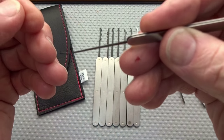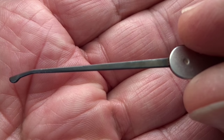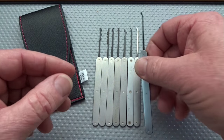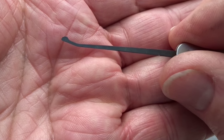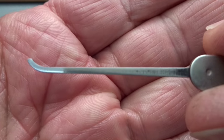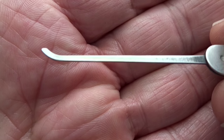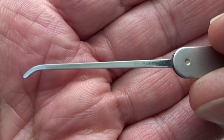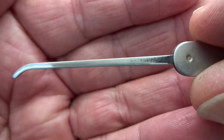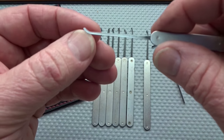I've picked a lock with them — they're not bad. Everything's rounded off, no sharp edges. If you take a close look at the picks, they are going to need a little bit of work. These are blackened, and I was a little worried about how durable that finish was. This, by the way, is a DeForest half ball — a good little pick for high lift. I went ahead and polished up the hook. This is a standard or short hook, and it took literally about 2 minutes with 1,000-grit sandpaper. They clean up and shine up very nicely. This carbon spring steel is a little bit softer than stainless steel, so when you do the sanding, just be a little bit careful — the material removes just a little bit faster.